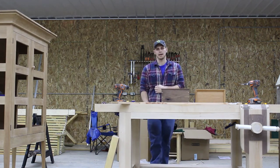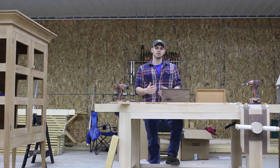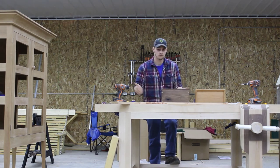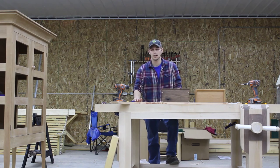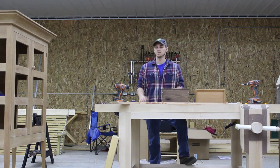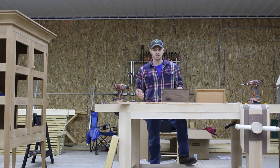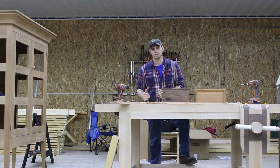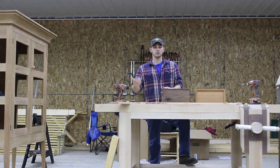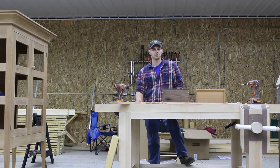Another thing to add: the seven steps of dimensioning lumber are a good baseline to use when setting up your shop. You don't even have to have a shop this size — you can just use your regular garage. If you want to get into woodworking and designate that space to it, you'll have to set it up in some manner. Keep those seven steps in the back of your head as you're setting it up, because whatever flows best for you using those seven steps is where you're going to start on any project. Step one, rough cutting to length, is where you're bringing your lumber in — have your radial arm saw or chop saw ready.